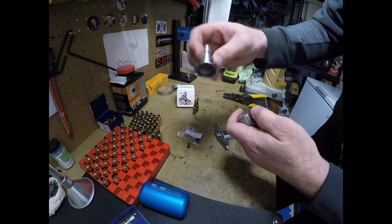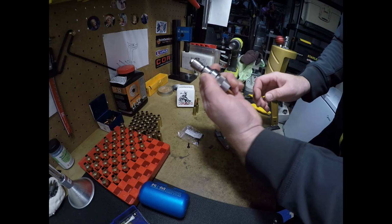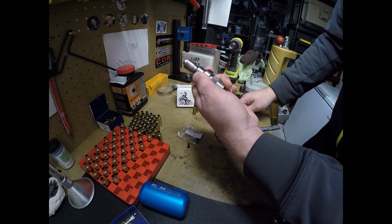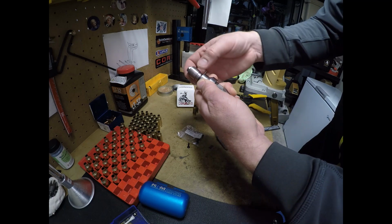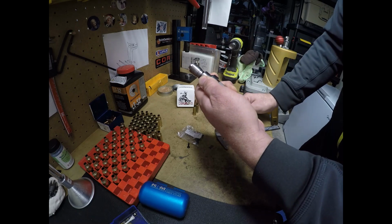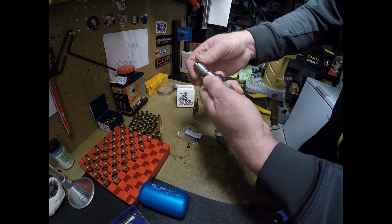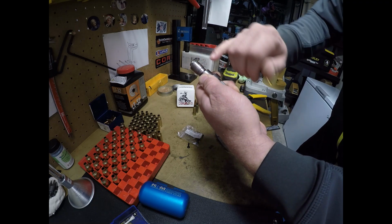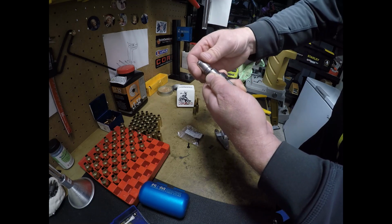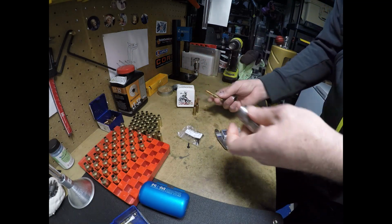And then this little micrometer here, you throw that on top, hold the two together and turn it, and it gives you a measurement. This one is 4 thousandths below zero, so I would call this -4, because you have a 0 right there, and it's 4 thousandths below. Each line is 1 thousandth, so there's 1, 2, 3, 4. So I would call this one -4 thousandths.